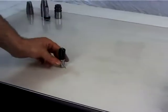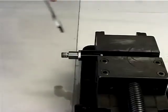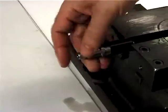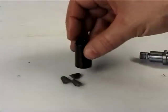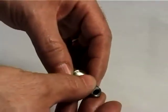Fasten the clamps holding cone, figure 17, in an adequate vise. Then, by means of a 17 mm wrench, dismount the cone holder, figure 20. Take the 3 clamps out, figure 16, then remove the spring and the clamp opener, figures 18 and 19, from the cone holder.